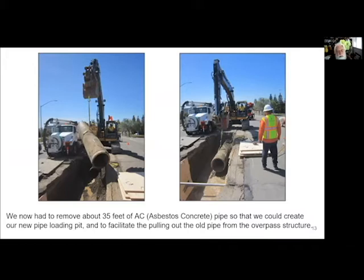Now we needed to basically start digging back and creating a pit where we're going to do the loading of the pipe, because we're going to pull it from the west side to the east. And so we just ended up going back, backing out the material here and pulling out the 30-inch AC. Basically, we cut away the bands where the thing comes together. So those are 12-foot lengths that we're pulling out.